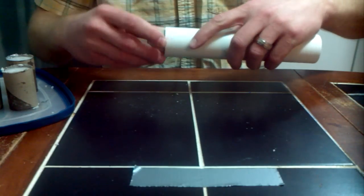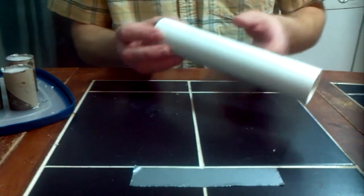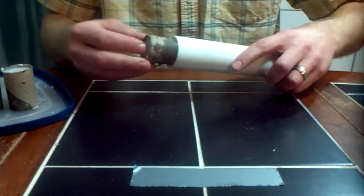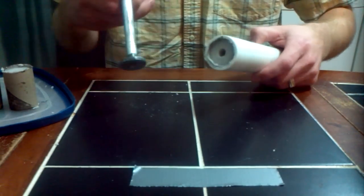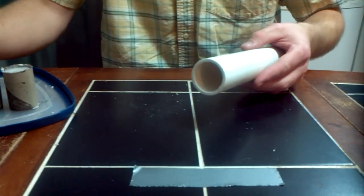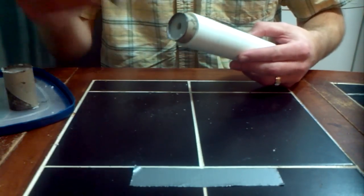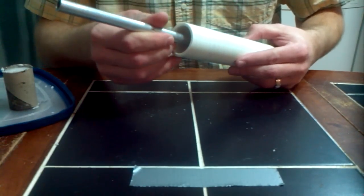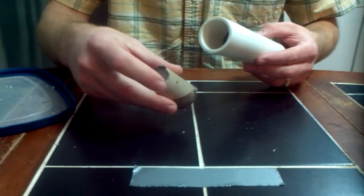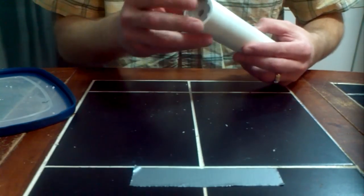You don't want them to be really tight because you're going to end up forcing it, and you don't want to crack a grain. That one went in there perfect, like it was made for it. The second one is going in nicely as well. I take my coring tool at this point, just center it like I was making the fuel, and down it goes. Third one in. And a little excess there — we'll scrape that off. And now number four is in there.